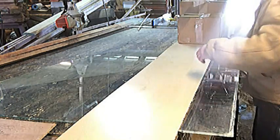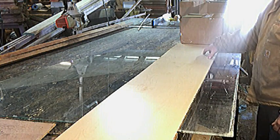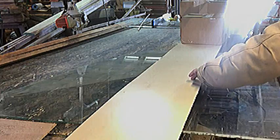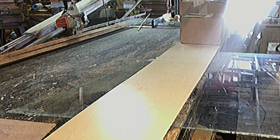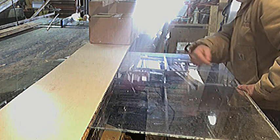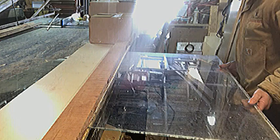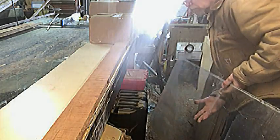I don't do this every day, so bear with me as I fumble through this. I lined up both the top piece along the table edge and brought the glass out, being very careful not to bend it. In theory, I should be able to just let the weight of the glass rest in my hand — I'm still giving it support. This piece of wood is pretty heavy but just gives me a little bit of extra pressure. Now I'm going to give the glass support and give a little downward snap. We got the first cut done — now we need to get the 40-inch side.